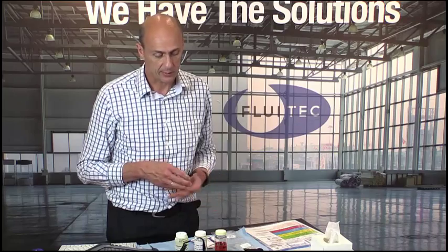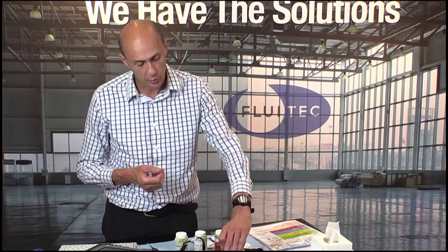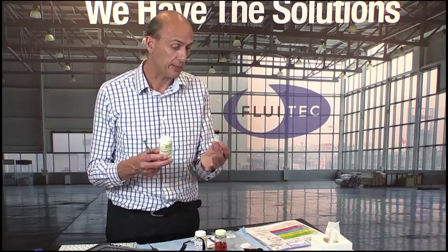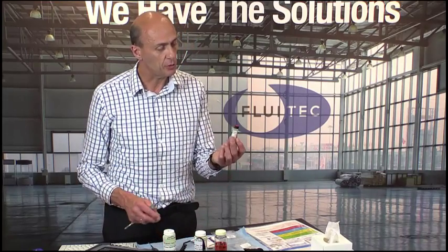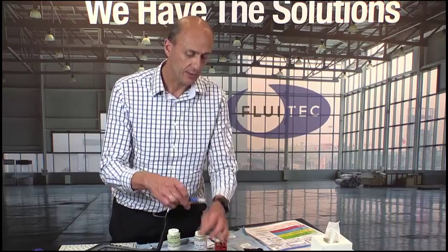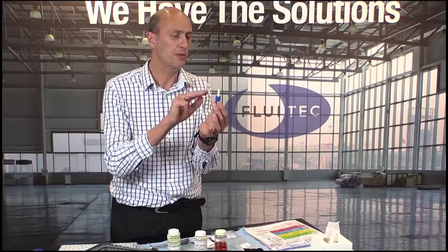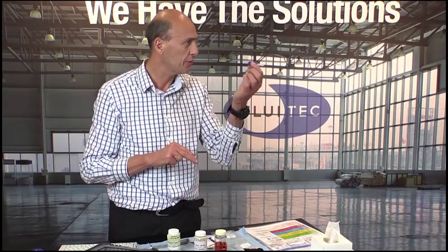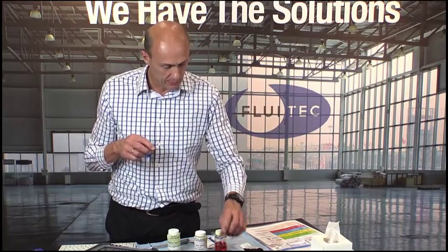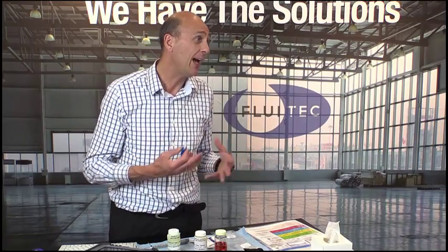The technology behind the measuring of antioxidants is cyclic voltammetry — it's an electrochemical technique. We are going to take an oil sample, add a small amount in this electrochemical test solution, and by doing this we extract the antioxidants out of the base oil. We apply this through a three-electrode sensing system — this is the heart of the RULER, consisting of three electrodes: two platinum and one glassy carbon electrode. With this we measure the antioxidants in our electrochemical test solution. By activating the antioxidants over this cyclic voltammetry technique, the quantity of active antioxidants will be measured.